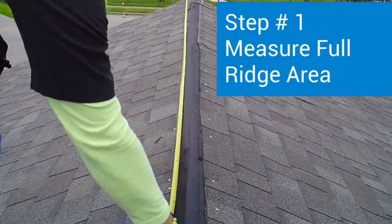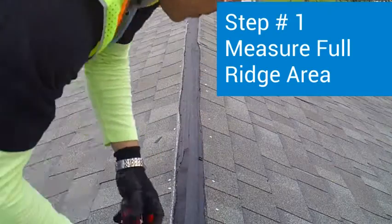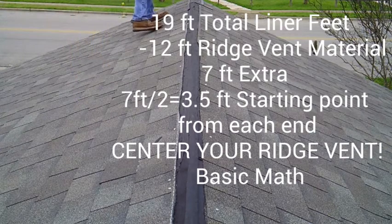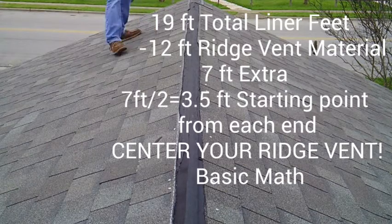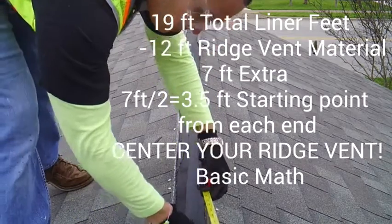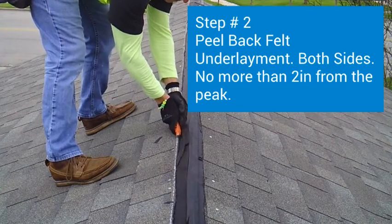Step 1. Measure the desired ridge line work area. Here's an example. This ridge peak measures a total of 19 feet. But we are only installing 12 feet of ridge vent material, which means that we have an extra 7 feet. These 7 feet, we like to divide by 2, which then gives us 3.5 feet. For the ridge vent to be centered and look aesthetically pleasing, we need to start 3.5 feet from each end. In the description below, I have a drawing with a diagram to better explain this.